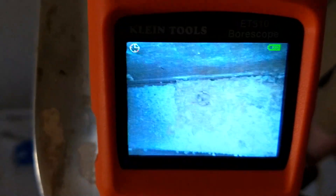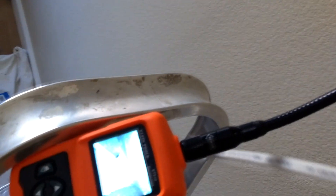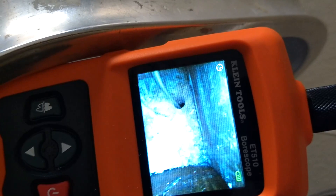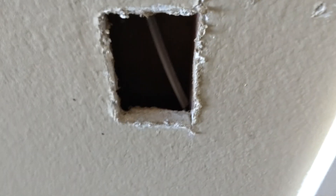Here's a picture from the bore scope showing the hole I just drilled. I've got the wire in there and just need to hit the hole. I'll reach my hand in to guide it — looking at the bore scope, I can see I'm very close, the wire is moving around in there, it's going in the hole. I'll feed through a couple of feet and then grab it from the other side. Sure enough, there's the wire right in the switch box — I'll just reach in, pull it through, and boom.